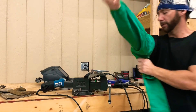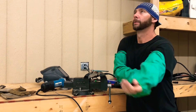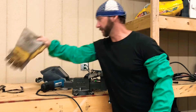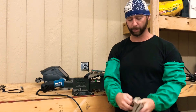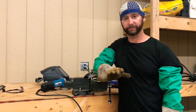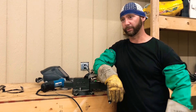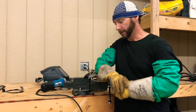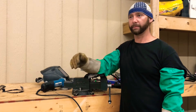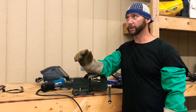So if you're a beginner, you probably don't know really how to set your machine. Even though somebody says you need to set it at 90 amps - okay, that's a good starting point, but that's not always exact. Different machines run differently; some might run hotter, some might run colder. I remember on one machine I was running 3/32 7018s and 90 was smoking hot, so I had to turn it down to around 75 amps - it burned great. But just about every other machine I ran, right around 90 is good. As a beginner you can't really tell yet whether your machine is too hot or too cold. It takes a little time and practice to learn how the metal flows, how the puddle reacts.